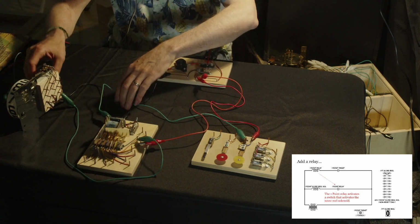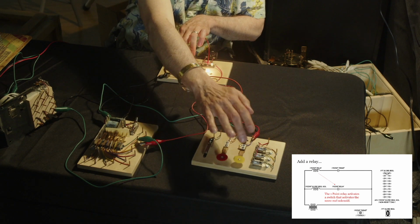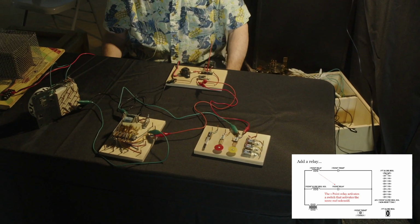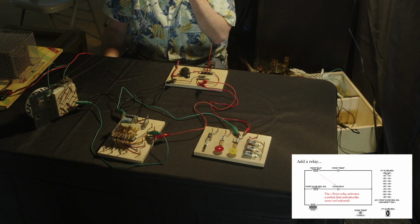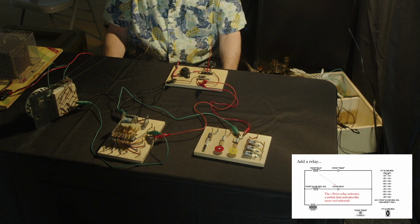But recognize, you've got these scoring relays in the head of your game. There's probably 3 of them for, say, 1 point, 10 point, and 100 points, or 10. I'm probably going to keep referring to 10 because I'm just used to that, the 1 is a dummy. So 10 point, 100 point, and 1,000 point. And so now we can go take a look at that, and it's working.